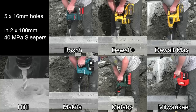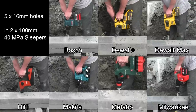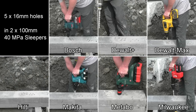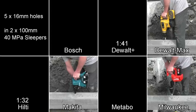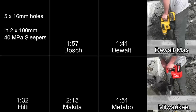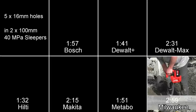Interestingly, the SDS Max units are really lagging here. I thought bigger is better, but it seems the higher BPM of the SDS Plus units really favours them — it goes against the numbers on the spec card but makes sense given what happened. The bigger joules on those Max units don't seem to help that much. The Hilti went really well. Bosch and Metabo both sneaking in under two minutes, Makita at two minutes 15, then the SDS Max units finishing — DeWalt at two minutes 30 and Milwaukee just under three minutes.